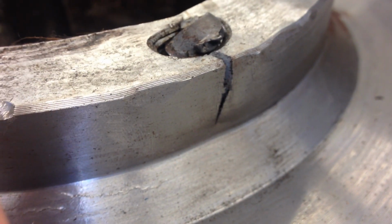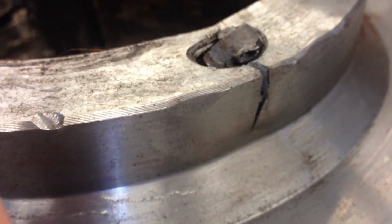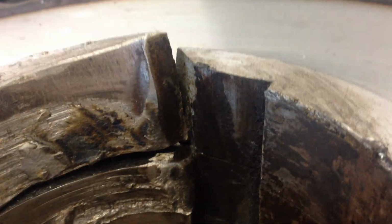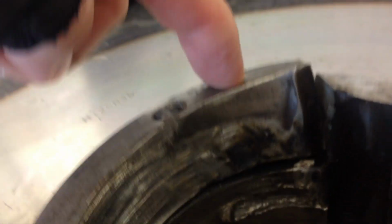Wow. It broke this rim, whatever this feature is. It's just the welded ring that's part of the taper lock, but literally, like I say, it's only halfway down the application. So I see. As soon as it was just not enough surface area to hold it when it jammed and just sheared it right off. And this ring gets welded on.